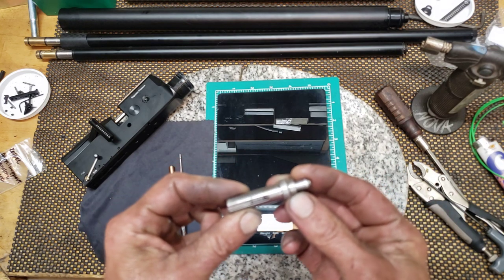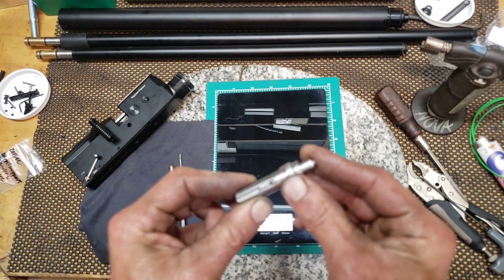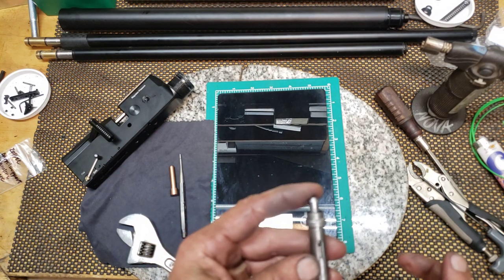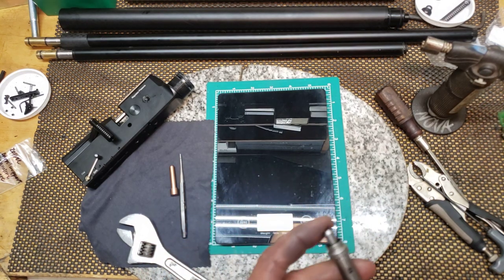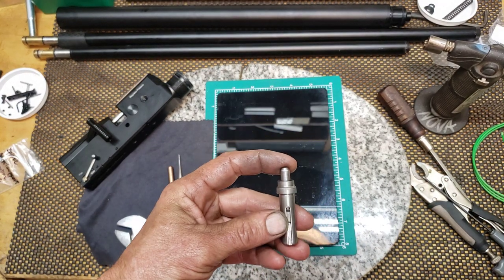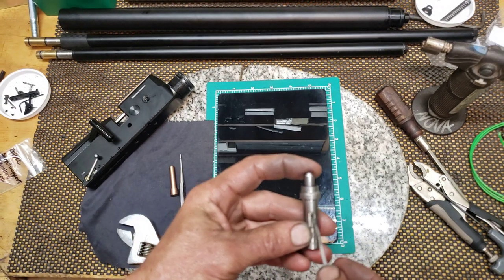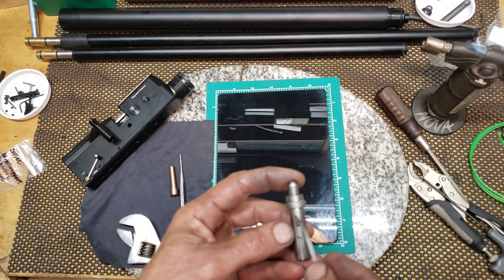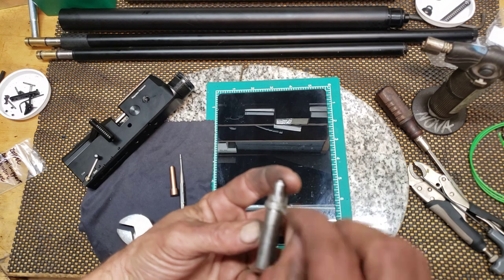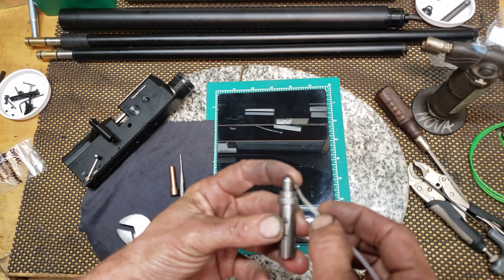This was not easy to get apart. Yours may vary. I'm going to show you what I did to get mine out — it wasn't all that easy, but it wasn't that hard either. First off, you have an O-ring right here and two slots right here. I took a zip tie, pushed that O-ring all the way out and got it off.